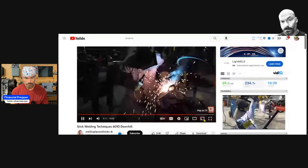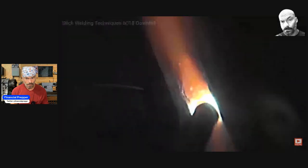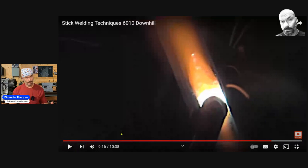Andrew's trying to prop with one hand and kind of gradually bend his knees. That's another thing — if you're holding on with one hand, you don't have that stability. I'm not harping on him or saying anything bad about it, but it would be a whole lot better if you could prop up on something, get a jack stand over there. I always had to get my arm on the pipe, get a finger on there. Sometimes you can do that if you're in a real tight jam, but as far as just holding on and welding, that wouldn't be my thing.